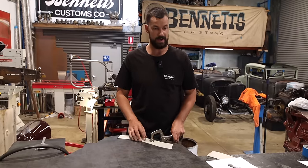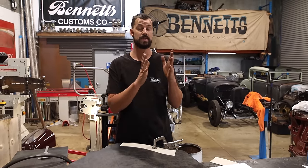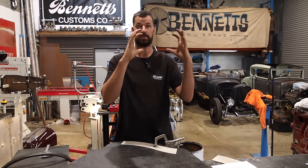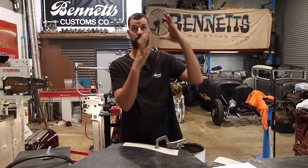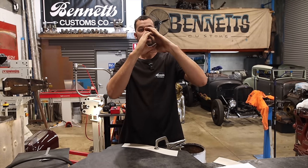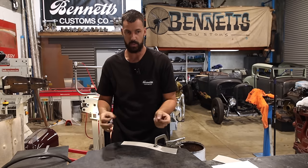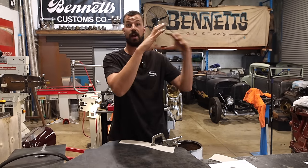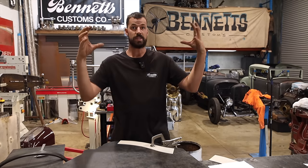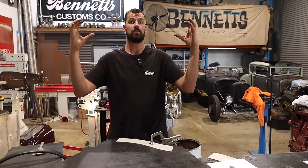So I've made up my mind what I'm going to try and do. Rather than welding to the frame itself, I'm going to make little boxes that sit in there with some sleeves, some bolts that will hold it in, and then a couple of bolts top and bottom. The C-channel of the frame will go right around it, and then everything will bolt in. That way I can pull it out, fully weld it, do whatever I want, and fully paint it before installing it. And then once it's all in there, it's not going anywhere, with all the high tensile bolts that will be holding it in.